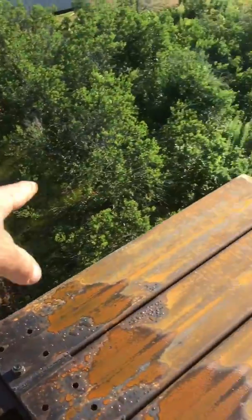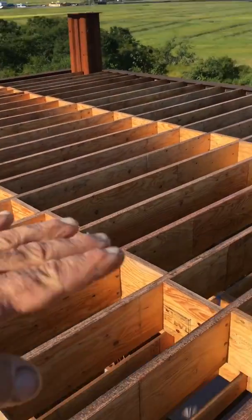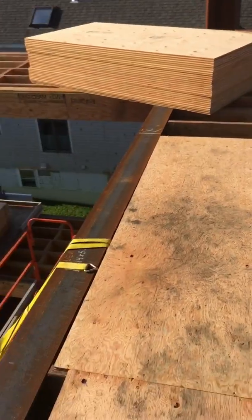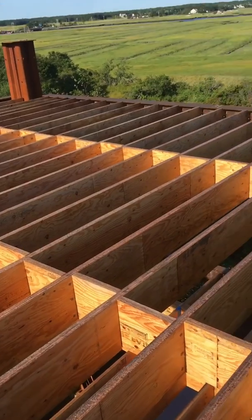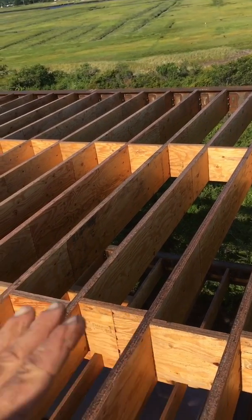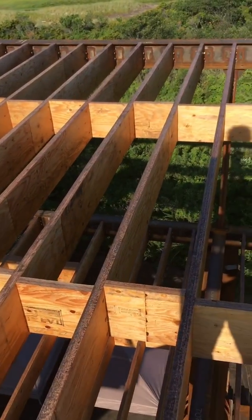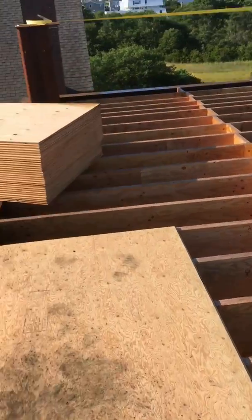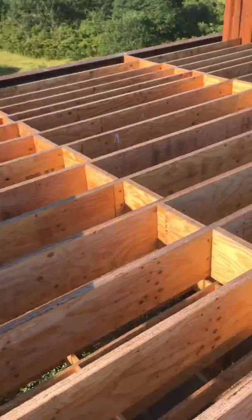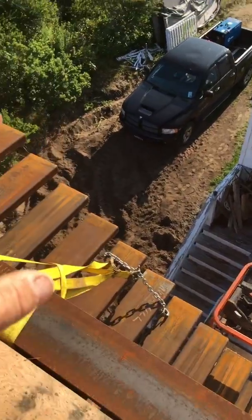There's a handrail later on, after the roof is done — it goes around the perimeter. Because this is a tapering roof, everything tapers to it with a main roof drain, which then drains down into a cistern underneath the first ground floor deck. After we have the tapering roof, it comes with a floating pedestal level floor, so we re-establish a level floor on top of a pitched floor. After the staircase is all welded and secured, we'll jump onto the roof.